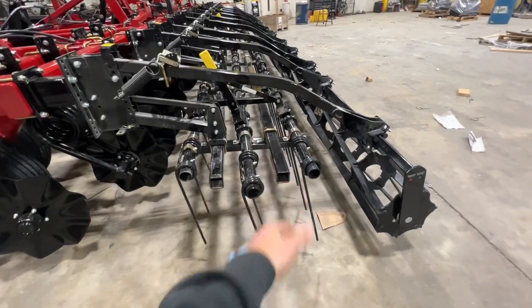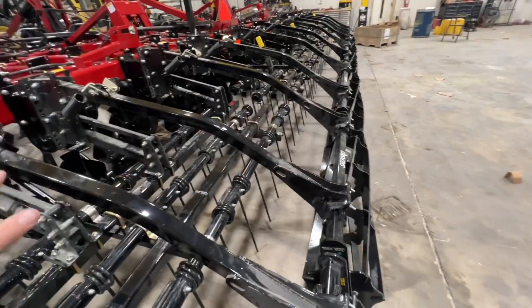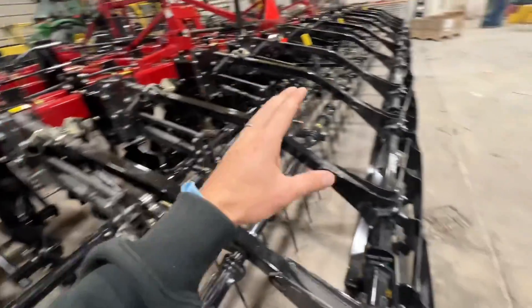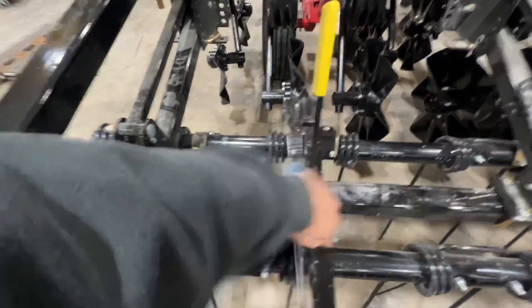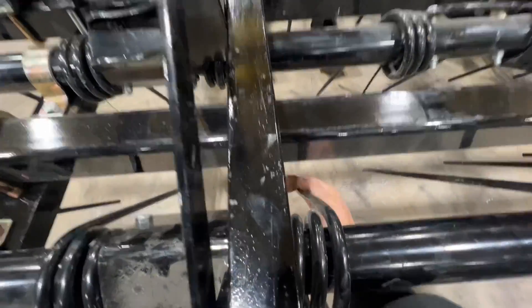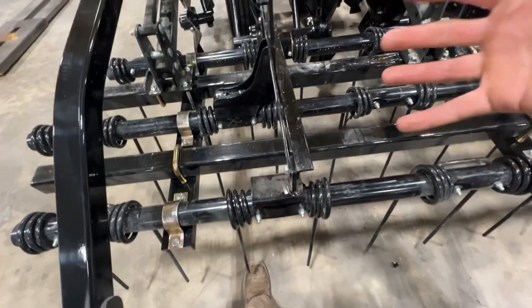We always finish off with the standard three-bar harrow and 14-inch rolling basket on this I-series tool. I get a lot of questions about what these harrows are responsible for — their job is one thing: side-to-side leveling. A lot of guys say they want a tool that levels, or they'll talk about the rolling basket leveling, but the rolling basket cannot level. What does the leveling is these harrows as they drag. You pull that pin and pull the arm back — the further you pull it back, the more tension and the more straight up-and-down these harrows are going to be.